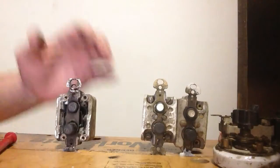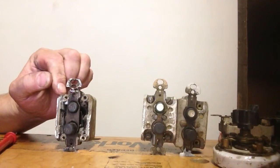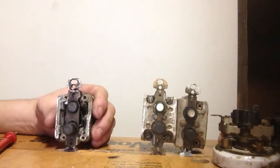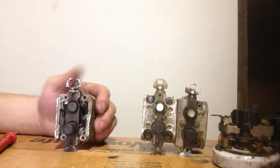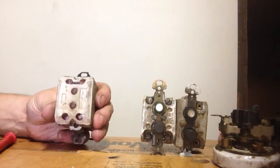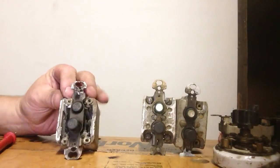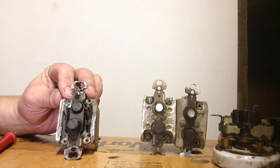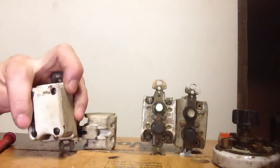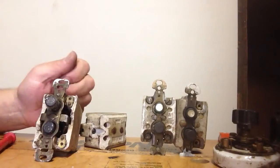It's very important to know how you took this switch out of the wall and where the wire was connected — on the common on here. So when you figure it out, you know where the common is on your new switch. You can test it with a gauge, or just look on the back and see where they're crossed over on the top. So wherever your one wire is connected on the top, that's the common. On this one, whenever the wire is connected to the side over here, that's your common. These two wires are your switch wires.